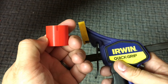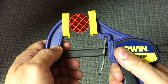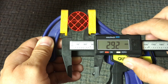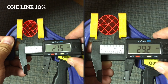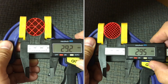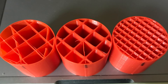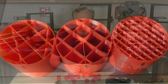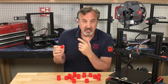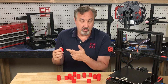Now what about crushing it? I'm going to crush at the same point — the seam and then the opposite side — three cranks, and I could feel it was much tighter. In fact, it felt like the 25%. Here they are side by side: the single line versus the double line, and the double line is clearly a lot stronger. Comparing it to the 25%, they're pretty equal. I am really surprised how well this double line infill worked — I never thought I could take a 10% infill and make it as strong as 25%, but it really does. You can even go triple or quadruple.